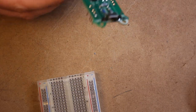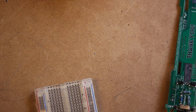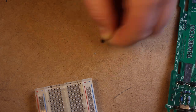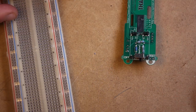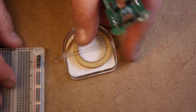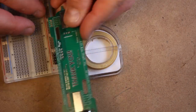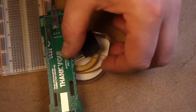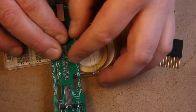So we have another shallow solder, and this one is for the gyroscope. I actually went a little too shallow on this. When I press the pins down, I press them down too much, and you'll see that when I go to remove the plastic part later, the solders just pull out, so that wasn't good. You can solder in this technique. It works fine. I've done it before, but I'll go ahead and show you this other technique where we solder from the top.